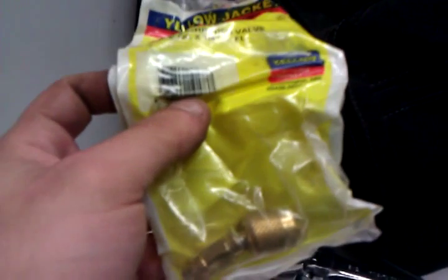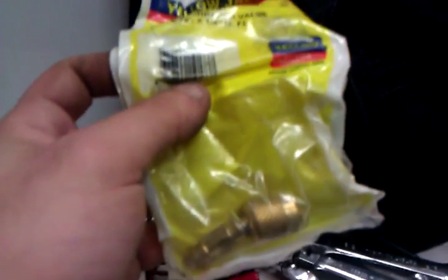These right here are the 410A fittings. You can't use your regular hoses to hook up to 410A — you need special valves on them. Johnstone sells them, part number is H2-6660. And the last thing before I run out of time is my box of screws. I always keep wire nuts, different valves, and slip-on connectors.